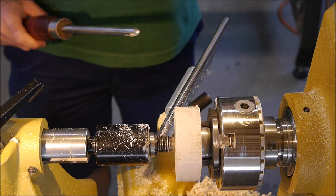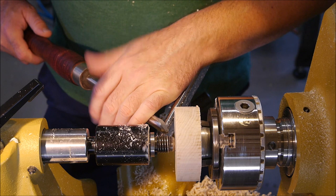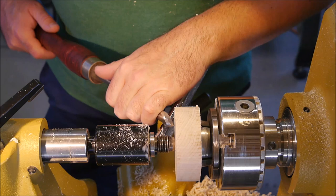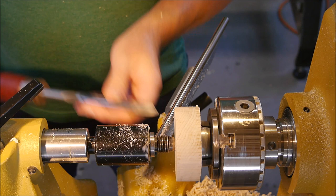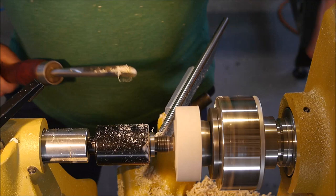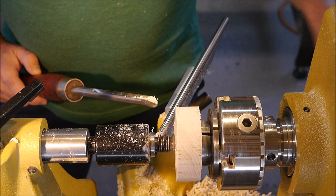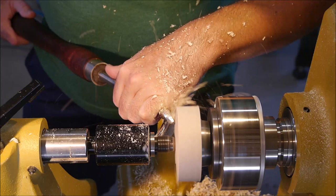For the first cut, I've got the gouge with the bevel lined up parallel to the lathe axis and I'm just going to take a series of bites going in this way to get down to the diameter of the tenon. A lot of times I'll see a beginner try to roll the gouge over and cut this way to level things off — that's not incorrect, but when you think about a side-grain blank you're cutting into end grain a lot of the time. So it's much easier to just make a series of bites like this and bring things down in that manner.